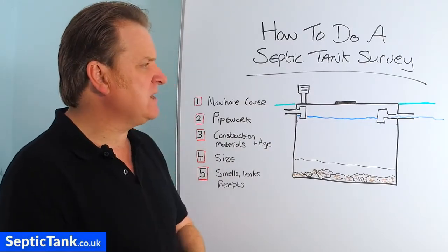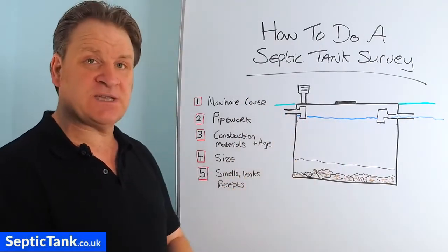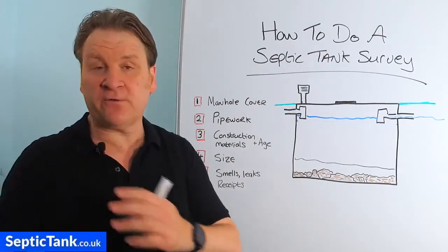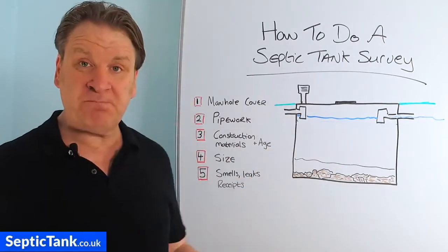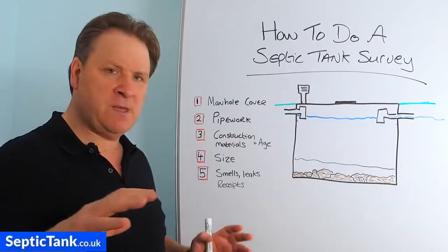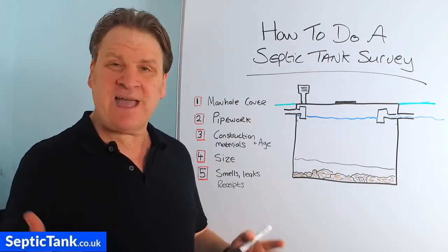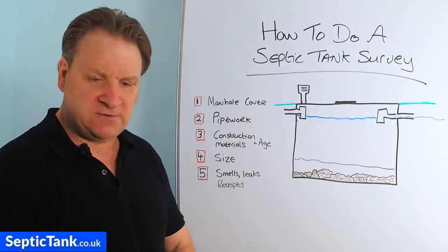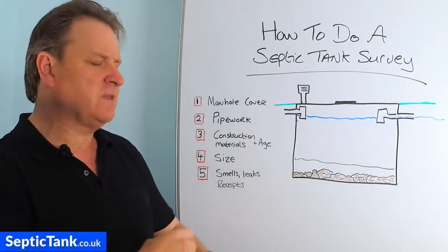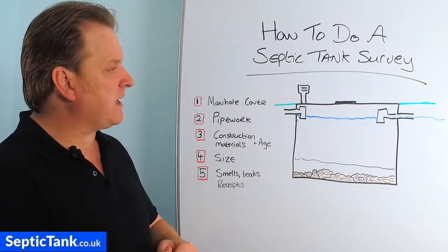Number two. When you inspect the inside of your septic tank, it's good to have two people — a friend to help you. Why? Because in septic tanks you can get a big build-up of methane. Many people have lifted the lid to inspect it, been overcome by the methane, knocked out, fallen into the tank, and been found at the bottom dead. If you've got a friend with you, you've got a harness on, and you're connected to a secure mounting, then if you are overcome by fumes, someone is there to help you and stop you falling in.